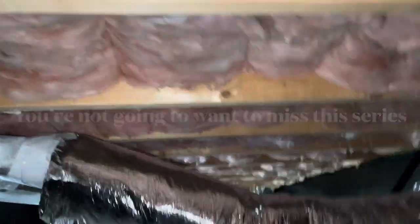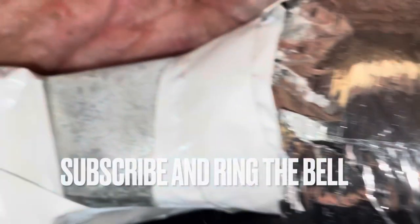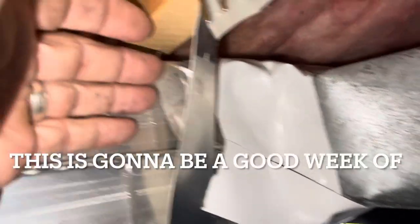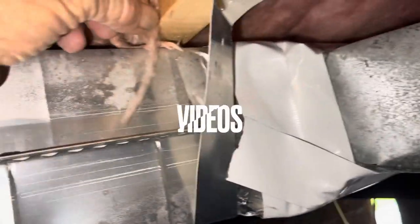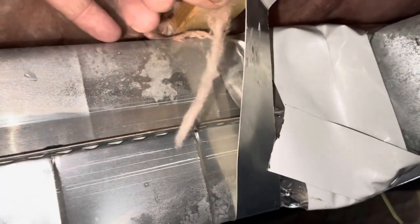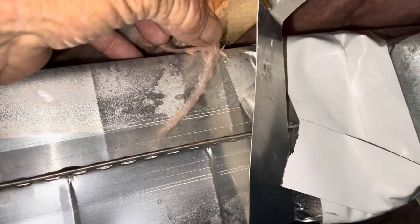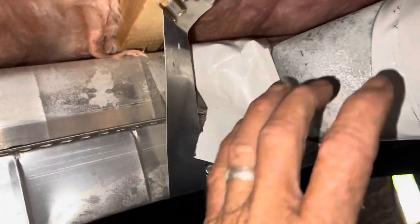All right, so we are reinstalling. Remember the vapor barrier towards the inside. I did find where we came under here at one time earlier and re-taped these vents. They are still leaking air — badly. It'll blow that piece of insulation straight over. That's bad. You don't want air blowing under your house like that. So we still have to re-tape every vent.